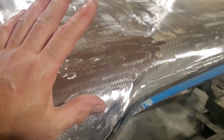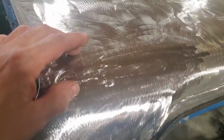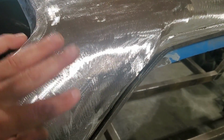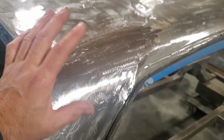We got that straightened away. It's the same process as what I did on the other side. I ended up welding it, grinding it, welding it again because I wanted to taper it back a bit on this top side edge, because where I overlapped it down here, I had to weld it again, then touch up a few spots and grind it off again, right? Anyway, okay, so I got this section done.